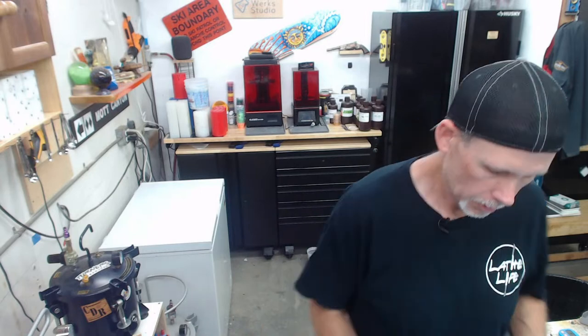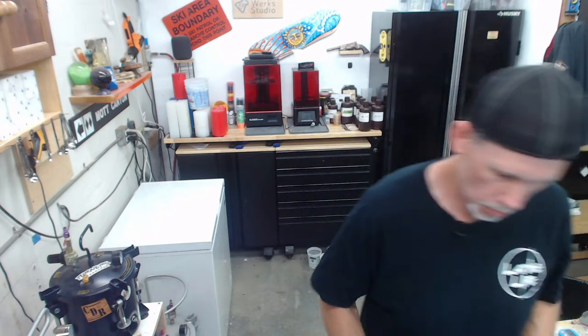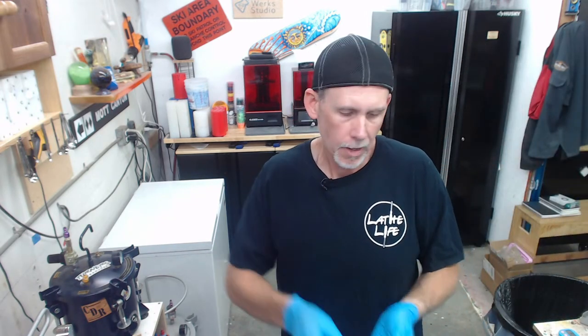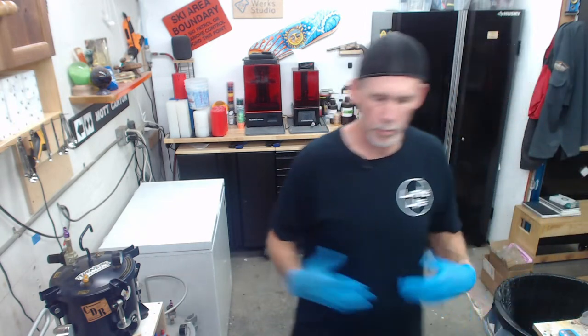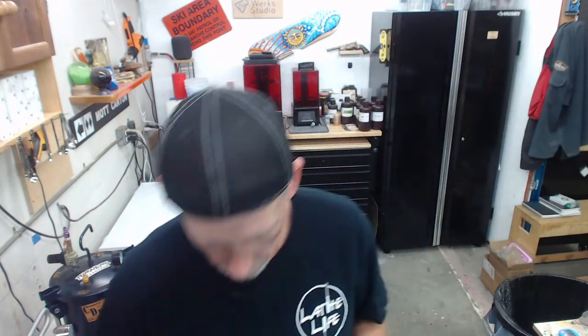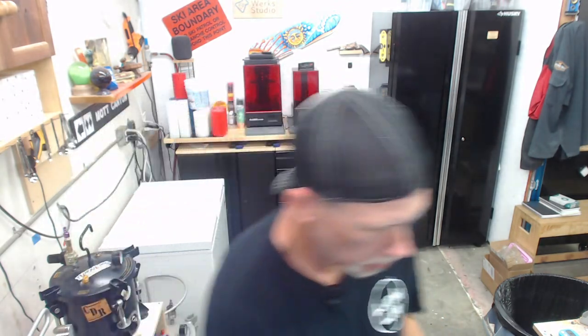For Alumilite Clear, the full cure schedule at room temperature is 5 days. At that point, it is fully hardened, and you're going to get the best polish at the hardest point that it can get to. So I usually recommend that. Now, I get away with doing stuff, and you can get things polished up. It's just going to be a little bit harder, and you might not get the best polish on it. It's not like you can't do it a little bit earlier than that, but better to wait.